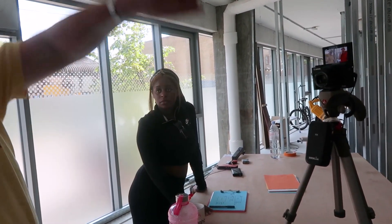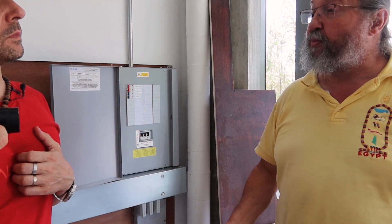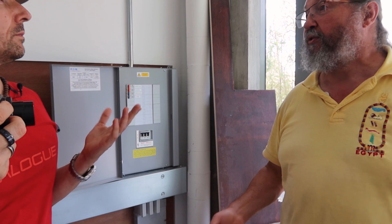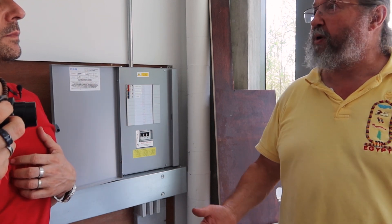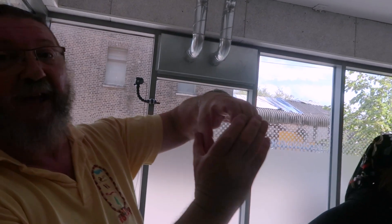You've got people walking through, so we may have to go across — it may only be a couple of dBs' difference, but it may be much more. If you're running balanced cables it makes no difference at all. But if you're running unbalanced cables — the output of a Fender Rhodes or most instruments — they're unbalanced, that's just the way it is. If possible, put unbalanced cables in a steel duct that is earth bonded — that will keep magnetic fields away from the cables on long runs.